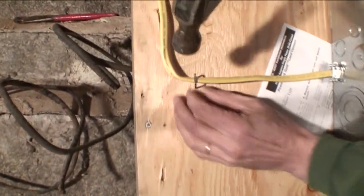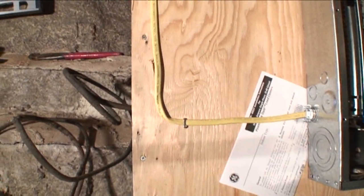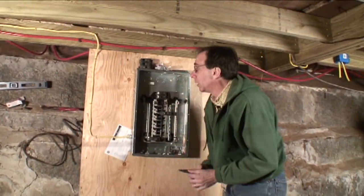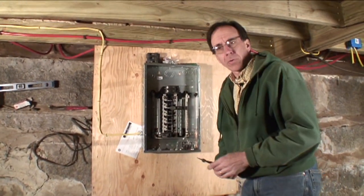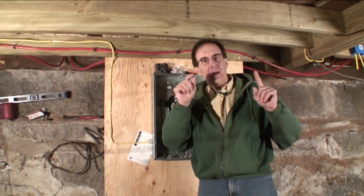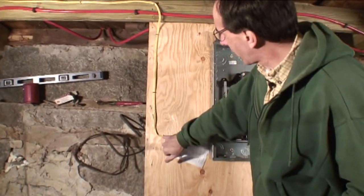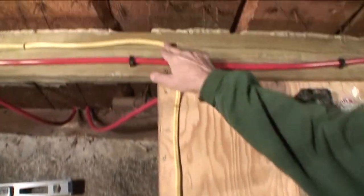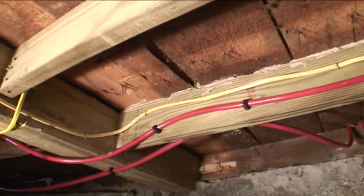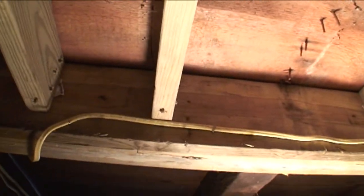We want to make sure that the wire is secure and everything is put in its proper place. When you're doing the run, every two or three feet I have a staple to hold the wire in place. You can see coming off this board I've got one, two, three right here, then going up anywhere I want it to be secure so it isn't going to move if it gets yanked on. It goes all the way across — staple here, staple here, staple here — and all the way out to the load.